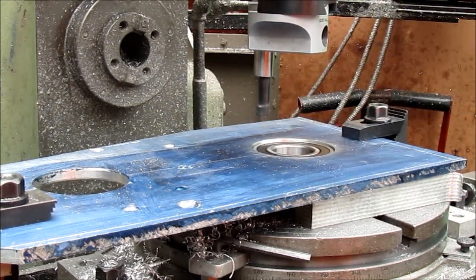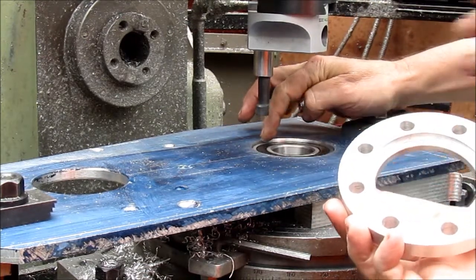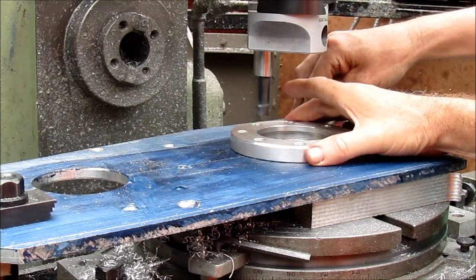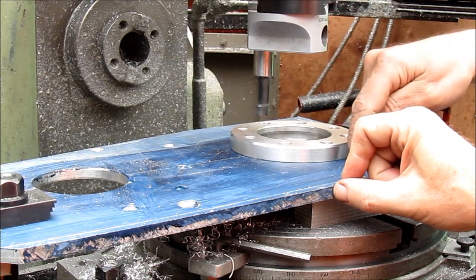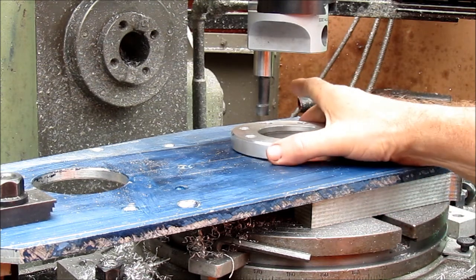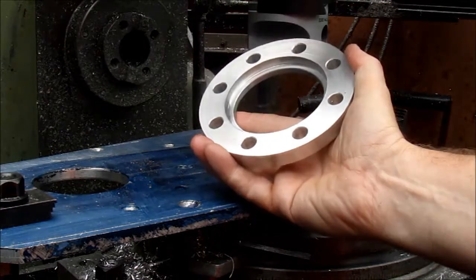You can't press it in the cap yet. We'll have to remove the plate to get it out. We've got this piece to hold it in place. Is it stuck? It will be pressed in — it's an interference fit in there, but it's a slide fit in the other part. Should we need to get the sprocket off, I've got to allow for that. So now you've got to drill this to match these holes. I can place it on there, mark the holes, and thread the plate. I'll use a ring of 8mm bolts. The holes are bigger than they should be but with 8 in there it's not going anywhere.